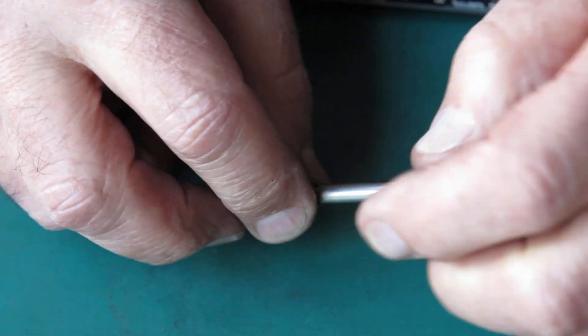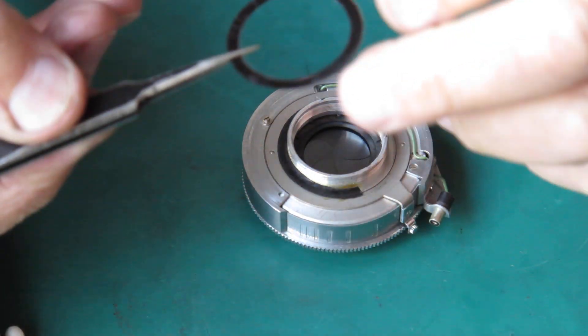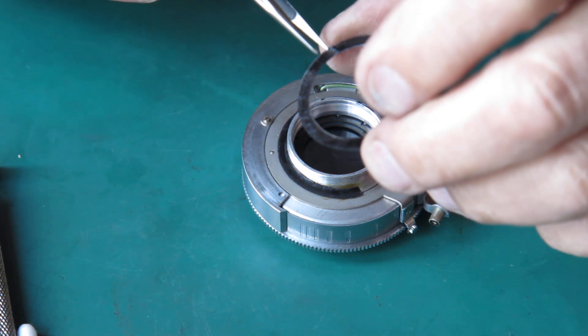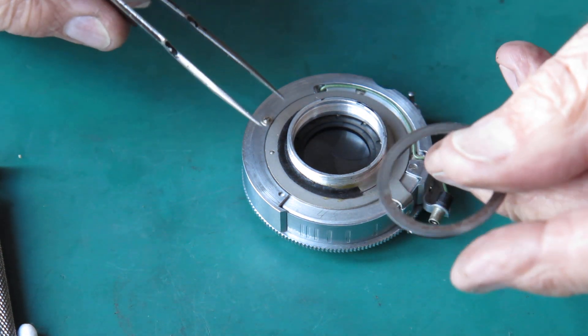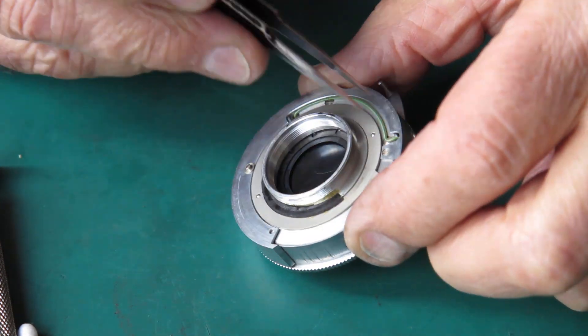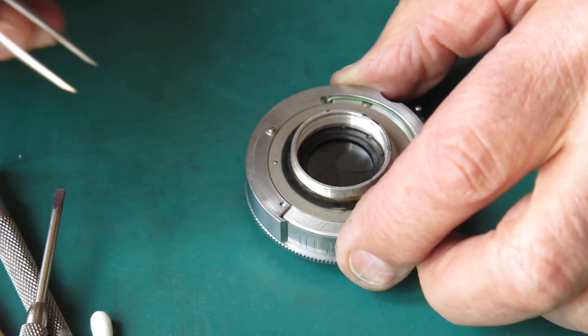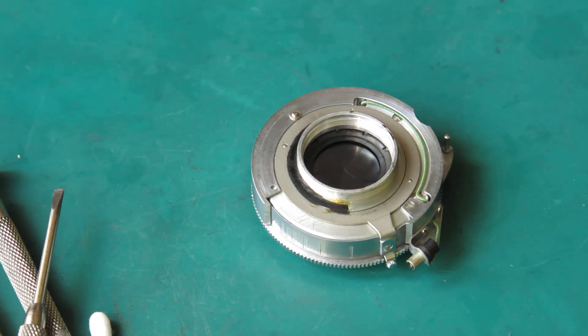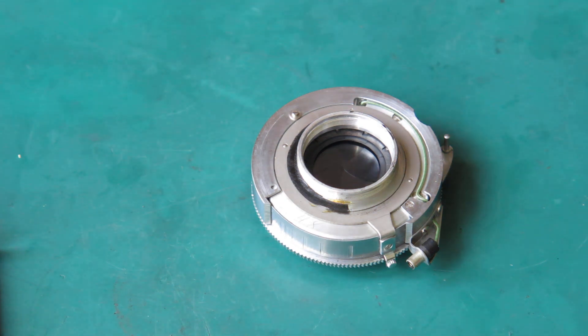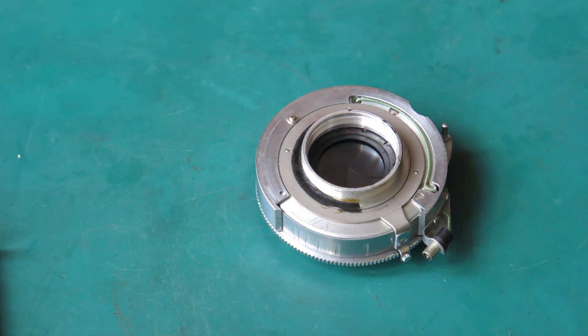More crimes against humanity. When I removed the shim rings at the back of the shutter, here's half of one — it's not a complete circle. And it's glued on there; someone put it on with glue. So we've got half a shim glued in place. Given that there were shims under the lens at the front of the shutter as well, it doesn't bode well for what I might find on the inside.